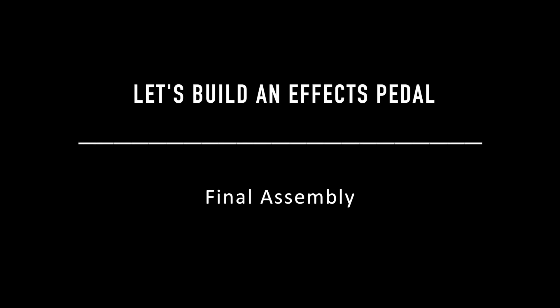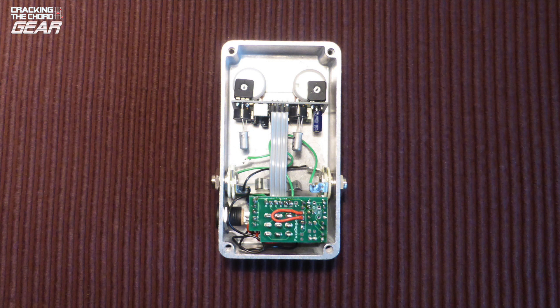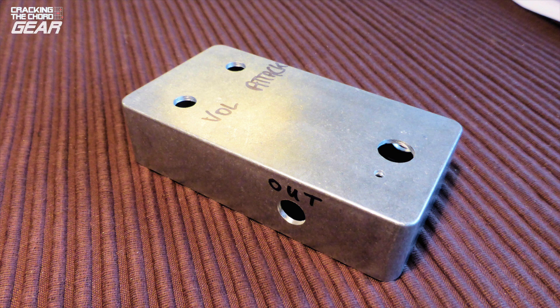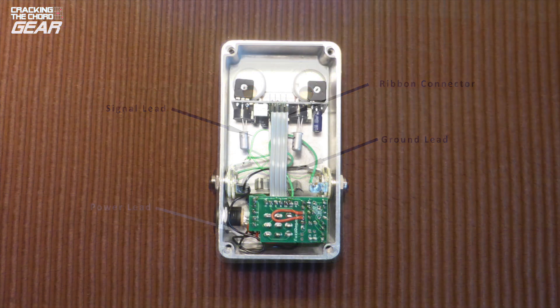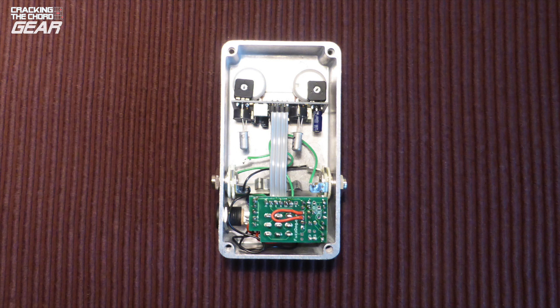Now it's time to install it in the enclosure and wire everything up. Having assembled the two boards we can now install the main board, daughter board and sockets in the enclosure. The hard part is assembling each board — putting the boards, jack sockets and power socket in the enclosure is pretty straightforward. Here are some tips: mark each socket and potentiometer location on the enclosure with a Sharpie, as working upside down makes it easy to mix things up. Colour code your leads — black for ground, green for signal and red for power. Before installing the charge pump daughter board, the last thing to do is solder in place the ribbon connector. You then install the main board and push the ribbon connector into the SIL socket. I then just quickly tested the unit before screwing on the base.